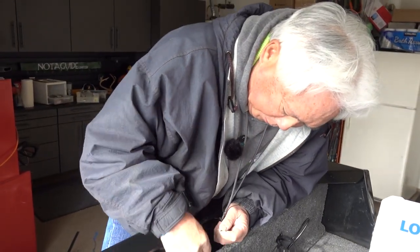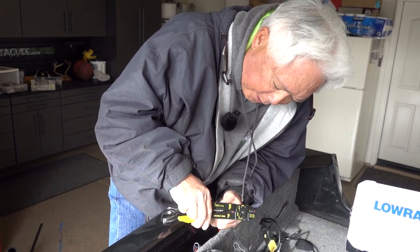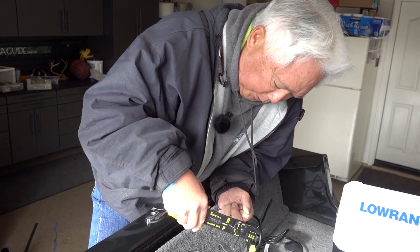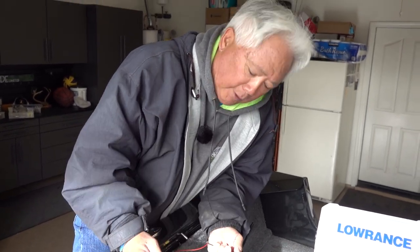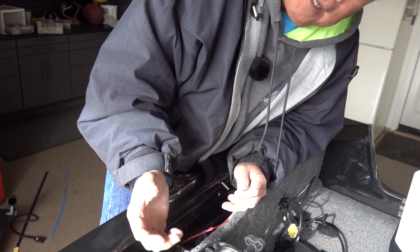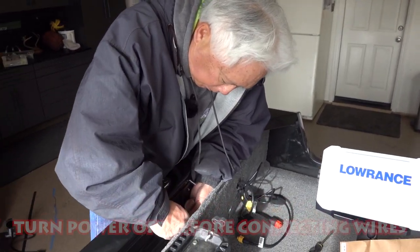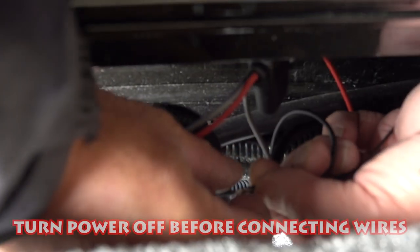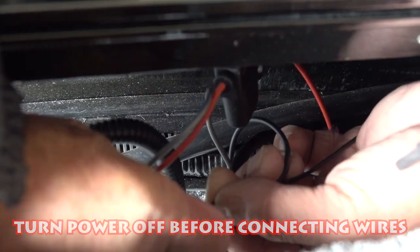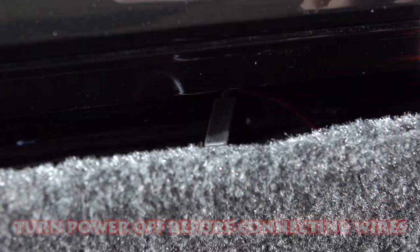What I'm doing is powering the unit. I went to the control panel and located the navigation light switch, so I'm going to power this fish finder onto the nav switch so he can turn it on and off whenever he doesn't need it. It doesn't hurt your lights — if you have the switch on it doesn't affect anything. I used a volt meter to make sure I was getting 12 volts with the switch on, then I made my connections and strapped them all down.